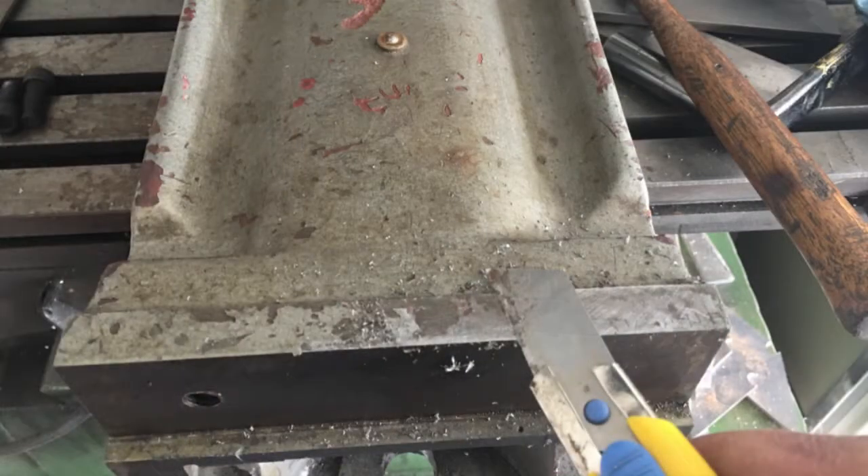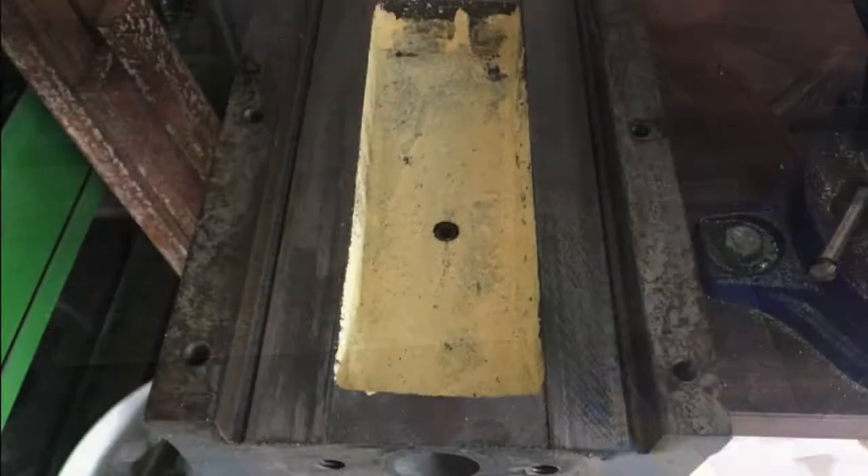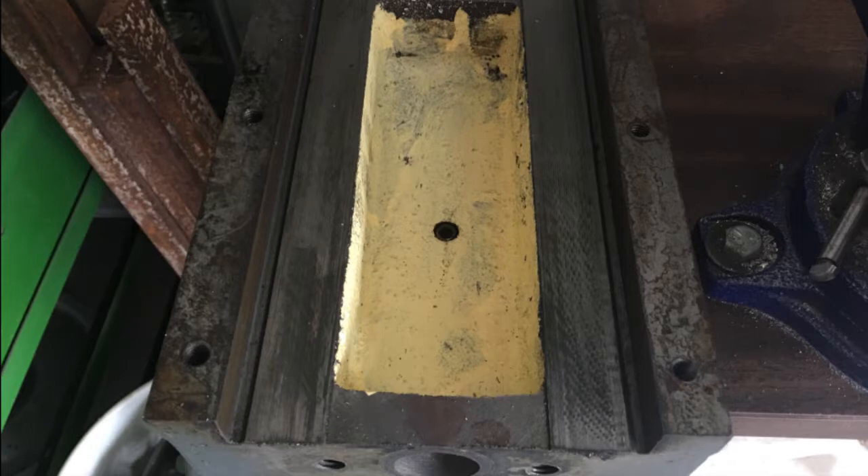Using a sharp blade edge, all the paint was scraped off the top flat surfaces — this will be important for the later setup. The grinding quality of this imported vise leaves much to be desired. The marks show the grind wheel was dull and heating up the cast iron.